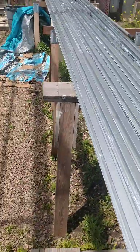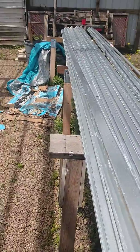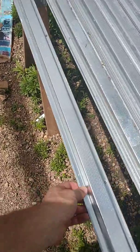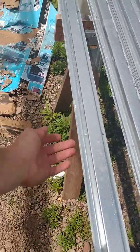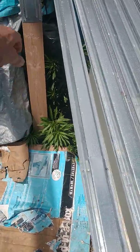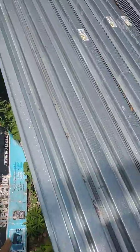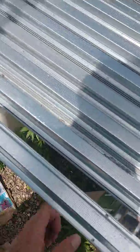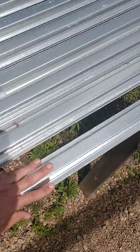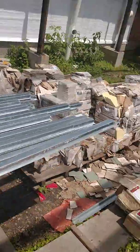if you remember, we were doing these folded steel ribs, and we were riveting the two ribs together to make one long rib. So you can see the rivets there, and there. And this is where the second one goes, and they're doubled up on the bottom here. So they kind of overlap, which gives them a little bit of extra rigidity so they're not going to fold.